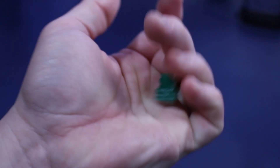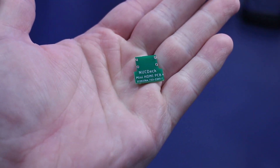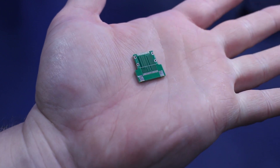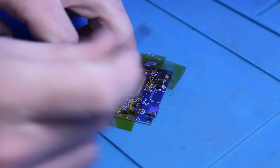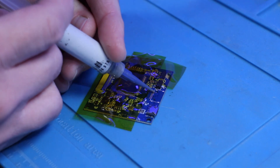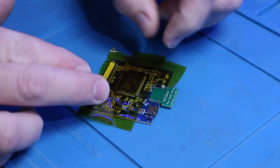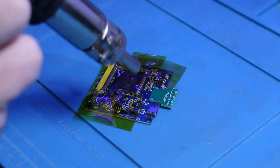I know you can get mini HDMI to ribbon cable adapters, but I don't have enough room to fit one of those in the current design. To solve this I devised a little PCB that solders directly on top of the display driver board and breaks the signals out to the correct spacing and order for a full-size HDMI port. Unfortunately, despite many attempts, I haven't been able to get it to solder on correctly with all of the pins making contact, and in the process I've managed to damage the traces of the driver board.